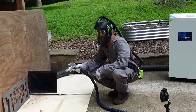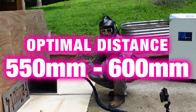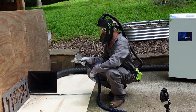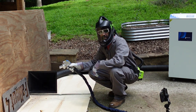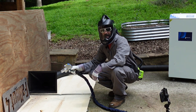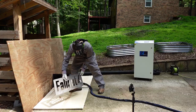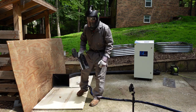There's an optimal focal distance for this particular laser cleaner, and you can easily find out where it is — just like with a fiber laser engraver. Shoot it from far away and as soon as you're in focus, you'll see that's the optimal distance you want to be. So you want to constantly try to keep that distance. Pretty awesome — I'd say all the rust is removed off of that.